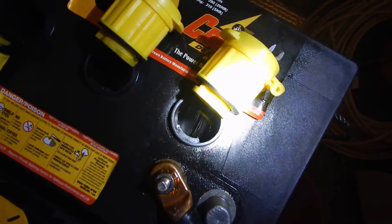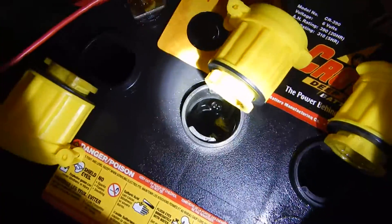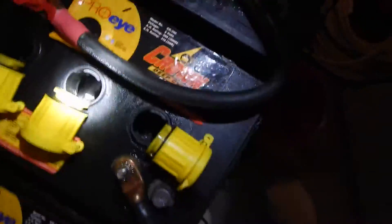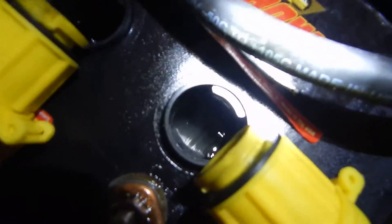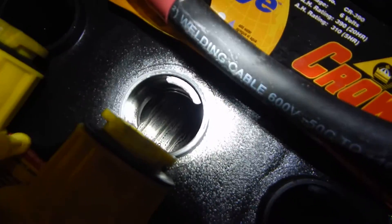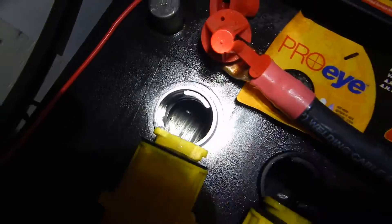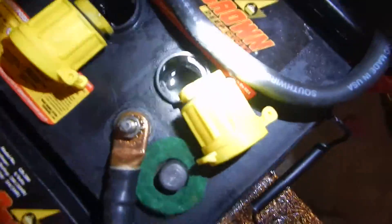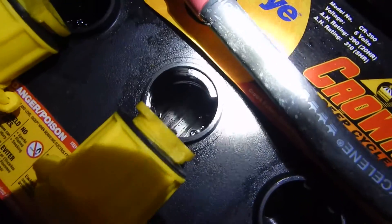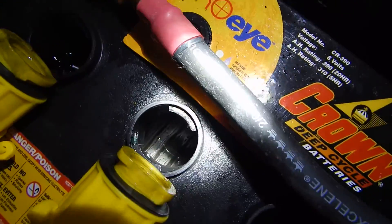This is an 11-day update. It's 11 days out of what may take 20 cycles, which would be 20 days. The reddish brown plates you see in there are the positive plates; the gray are the negative. Those were the two-year-old batteries. These batteries are about four months newer.